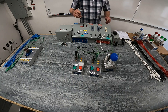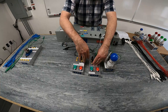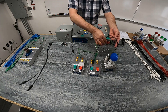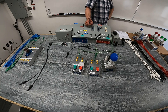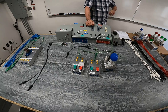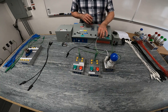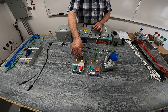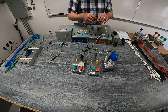The next procedure, I'm going to take these apart from the source, and just leave the connection to the light fixture and load. The second procedure is asking us to draw a schematic for two normally closed push buttons in series with each other. I expect you to draw a schematic of this. Our red buttons are normally closed, so I'll come from my power supply, feed into switch one, come out of switch one, and make it in series with switch two.